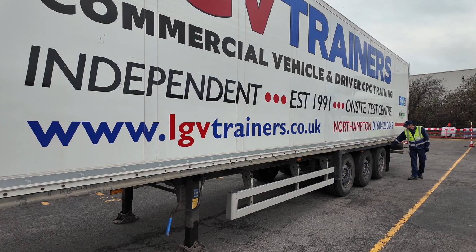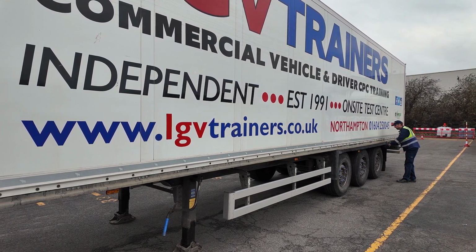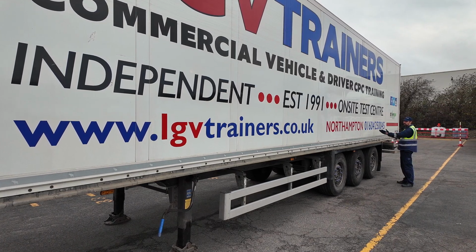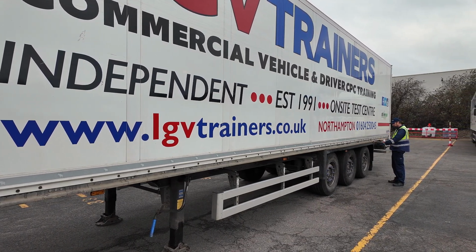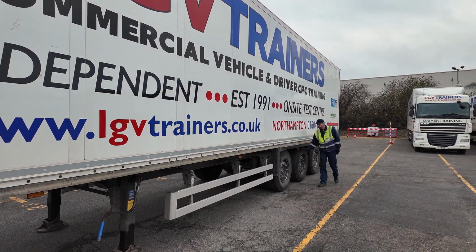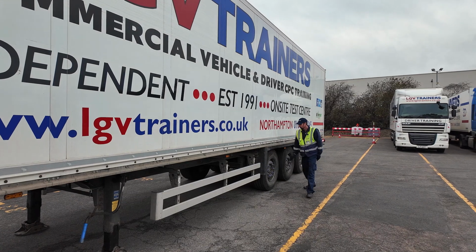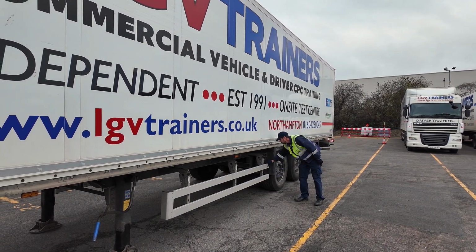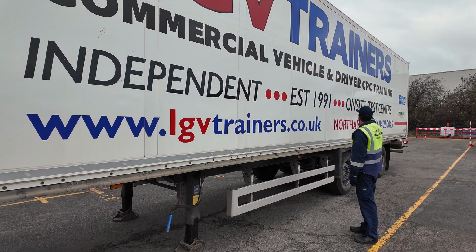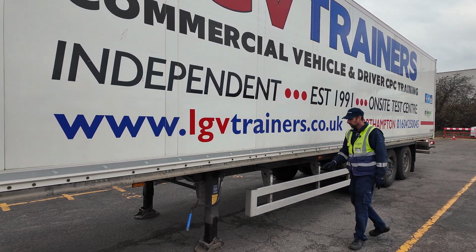So continuing down this side, make sure the mud guards are secure. Again, for quickness on the test, I will check the tyres. I'd say to the examiner, I will do the same checks as the other side with the tread depth, condition and the wheel nuts, but in real life, give it a thorough check. So make sure they're okay. Again, marker lights clean, secure. Side rails secure. Again, the side of the trailer, check the condition, there's no damage, that looks okay as well.